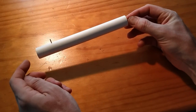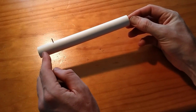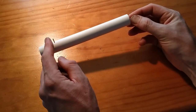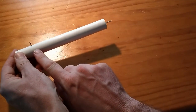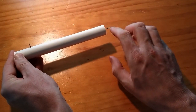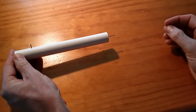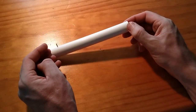The inlet of the gun comes here, the powder will come up into this chamber, and you'll have your positive yellow wire connected to this little bit of wire protruding there. The particles will charge, and as the powder exits the gun and heads to the workpiece attached to the blue wire, you'll see that it will cling there. So that's how you make the electrostatic chamber.